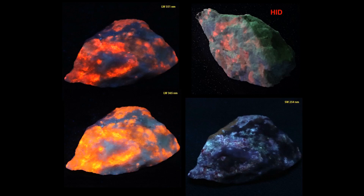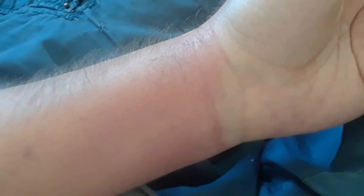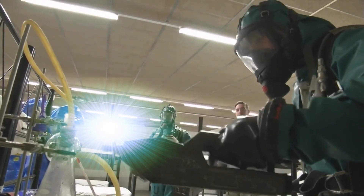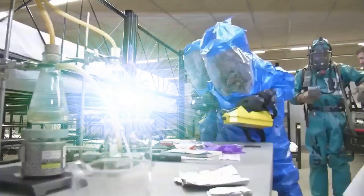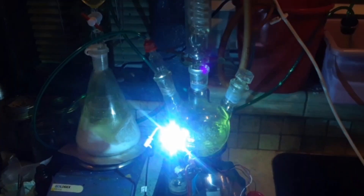The unfiltered HID headlight peaks somewhere below 350 nm, has the high intensity output needed, is not an electrocution hazard, is easy to use, and dirt cheap. This makes it not just suitable, but perfect for UV photolysis. As evidence of this, I spent just a couple of minutes chasing down leaks in the gas connections on my apparatus, and received a first degree sunburn to my arms and face. I wore eye protection the entire time, but in hindsight I should have worn long sleeves, sunscreen, and perhaps a face shield. Despite being aware of the potential for UV burns, I proceeded carelessly. However, this is proof that we have intense output in the appropriate spectra. I urge you to avoid exposure and use full protection if you use one of these lamps, including sunscreen for exposed skin.